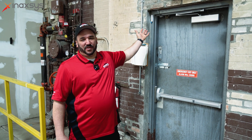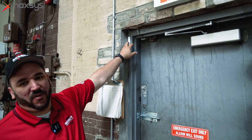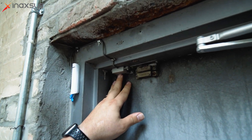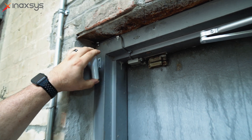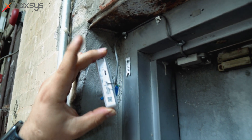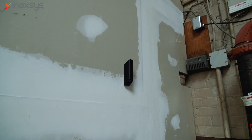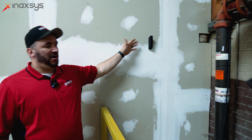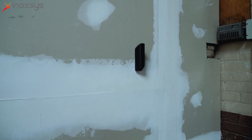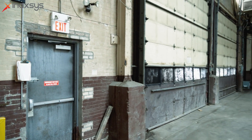We're here to show off the external door contact utilization with the Ajax door contact sensor. As you can see, we have no Ajax magnet on here — we're utilizing the existing exterior door contact, wired through B-connect wiring to the clip in the back of the Ajax door protect contact. We also have the Ajax curtain on the wall, which works almost like a motion sensor but is always active, creating a laser barrier across the wall. We're using the door contact on the man door and the curtain to cover the overhead doors.